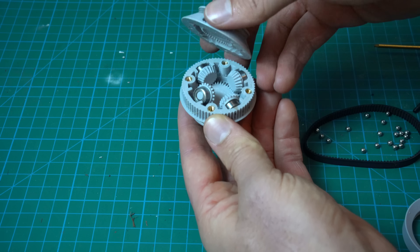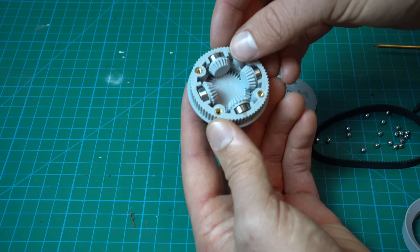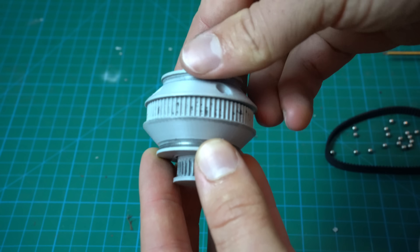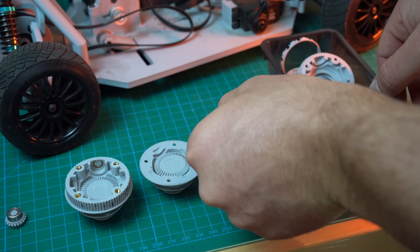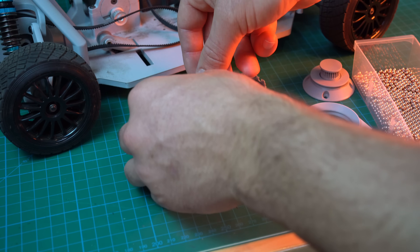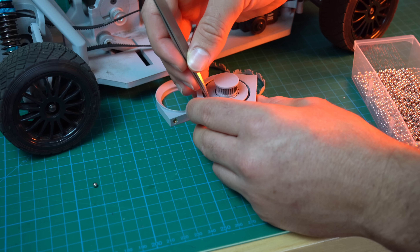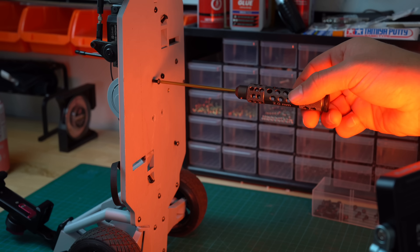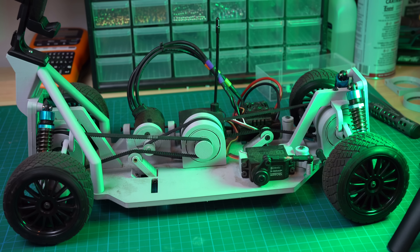Looking closely at the outer races, one had a lot more wear — almost as if colored with pencil lead — suggesting much more friction on one side, supporting my theory that too much heat or centrifugal force caused a ball bearing to embed itself into the soft plastic race. There are spherical indents along the outer race on one side. Cracking open the differential, to my delight the bevel gears were in really good shape, almost as if they hadn't been run at all, meaning there wasn't much heat through the differential itself. I'm not 100% sure what happened, but it involves the ball bearings. I'd love to hear your theory in the comments — and let me know if you think the whole belt drive system is barking up the wrong tree, or if I should return to off-the-shelf axles. Please support the channel by liking and subscribing, and stay tuned for the next episode covering the final design based on your feedback, with printable files released.